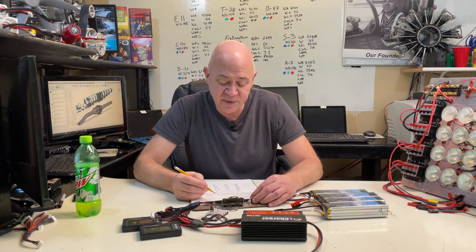I want to go through how I've had so much success doing parallel charging. I know I've read forums where they say it's the absolute most dangerous thing you can do. I'm not going to debate that because if you don't know what you're doing, it could be quite dangerous. But to me, it's just as dangerous as charging batteries that might have a bad cell and you walking away not knowing it and burning down your garage. If you balance charge with a good balance charger, 99% of the time the balance charger is going to save your ass.